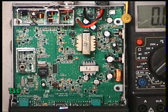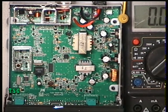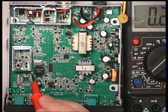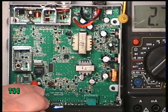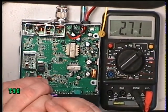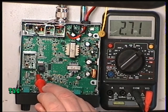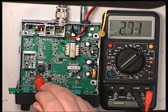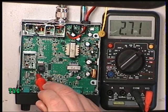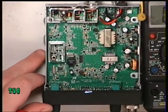We are on the TTI TCB 550N, which is the new version. I don't have a service manual for this and it's totally different to the non-N version. What I've determined is that the VCO test point is just there. If I zoom out, we'll see what we've got on the meter — I'm on channel 20 on the UK band. If I'm going to transmit, we've also got 2.7, so that looks like the VCO test point.